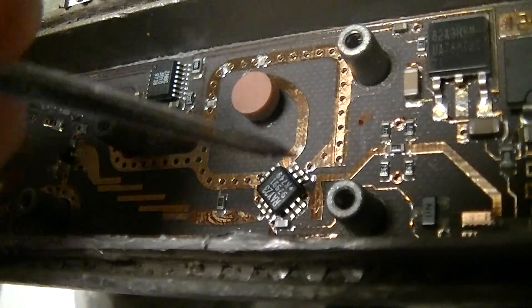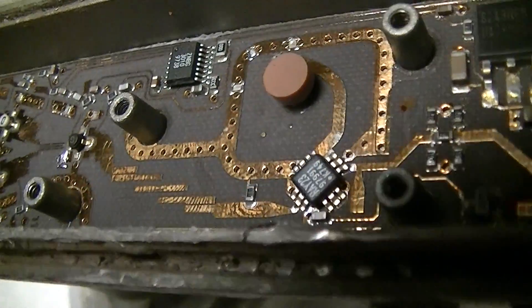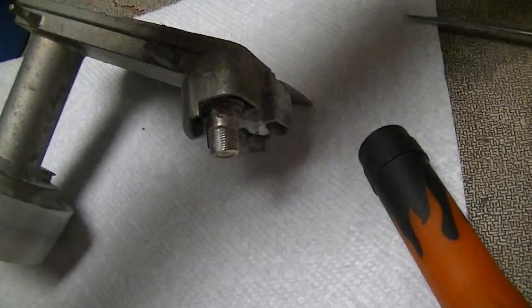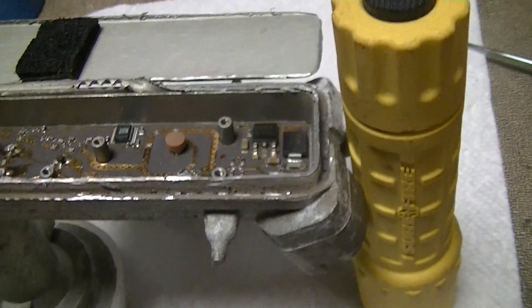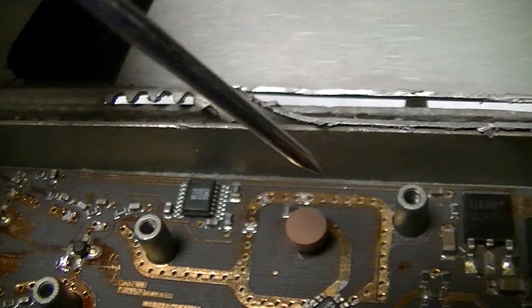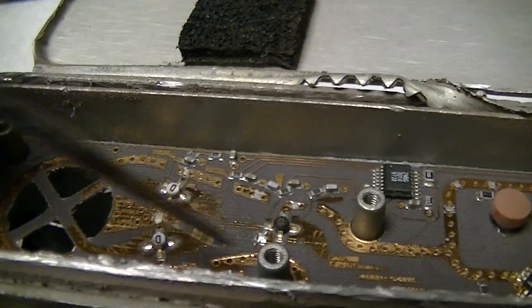That means the trace is very high inductance, and that helps attenuate any crap on it. Then there's another bypass cap, and it just connects to that IC right there. Another trace up there powers this FET driver — that is a ZNBG3010 — and that is just supplying all the bias potentials for the three FETs.